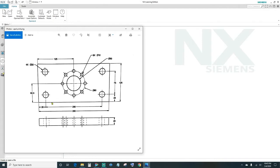Once we have the block, we'll create four holes of 20 millimeters in diameter using the linear pattern. Then we have the 10 millimeter holes — we've got eight of those going in 360 degrees, so we have to use a circular pattern. I'll go ahead and show you both of those.